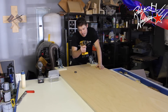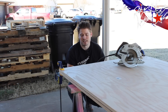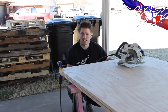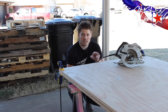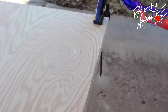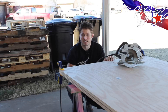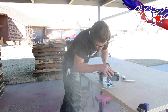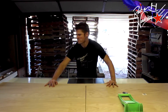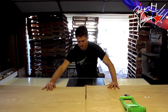Now, what I have is two three-quarter-inch pieces of plywood clamped together, all flush all the way around. I've already done some pre-marking — I've measured 30 inches from one bottom and 20 inches from the other end, and then drawn a line. I've also scribed it with a utility knife to prevent any splintering as I run the circular saw up the line. Now we're just going to take this piece and cut it down to 48 inches and use it for the back — or the side, however you want to look at it.